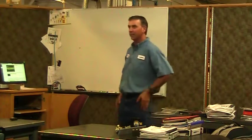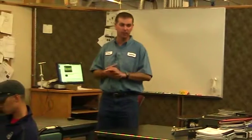Great technology. It allows you to run the engine at lower RPMs. It's quieter, it's more fuel efficient. When you're mowing around houses at dark-thirty in the morning, instead of being out there and wham, loud, these engines now run really low. So they're just barely running, turning an alternator, and then we can actually control the voltage with a little knob and control reel speed and mow at the same speed that a normal mechanical machine is doing, but at a lower RPM. So it's more efficient, it's quieter, so when you're around houses, you're not disturbing people. How many people want to be woken up at 5 in the morning by a guy going bzz, bzz, bzz, back and forth across the green? They get pretty upset. So now you can go out there and actually mow, and you can't even hear the machines. So technology is constantly changing.